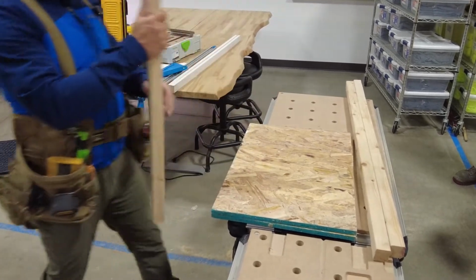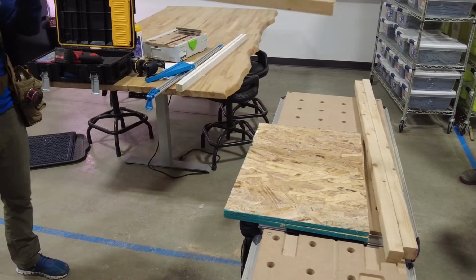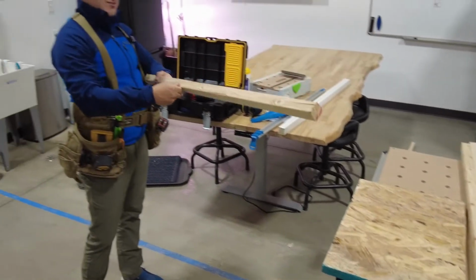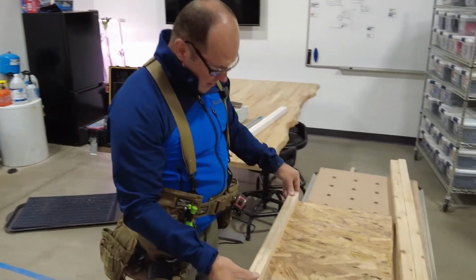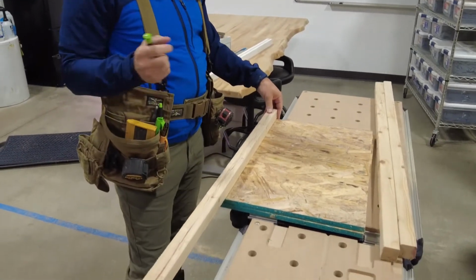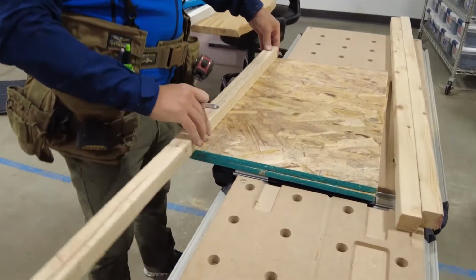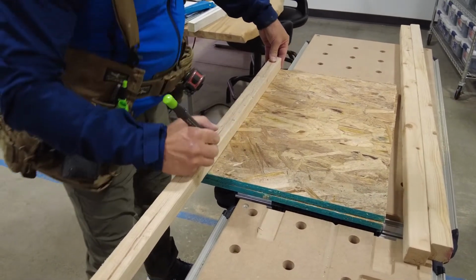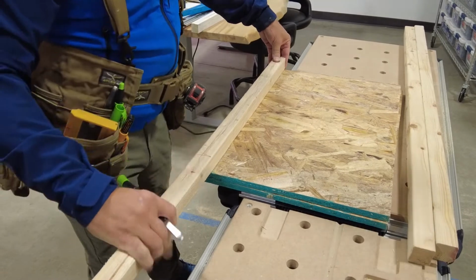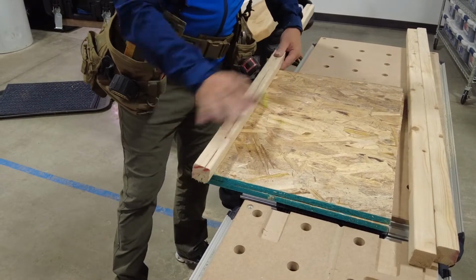Some of these 2x2s you get, they're going to be crazy. These are nailers, furring strips. They're junk wood because you use them for just scabs. And so just make sure you have good stuff. Don't be afraid to throw wood away. This nailer should not be the same length as the board. It should be real close, or it shouldn't be any longer. Let's say that, okay? Yeah.